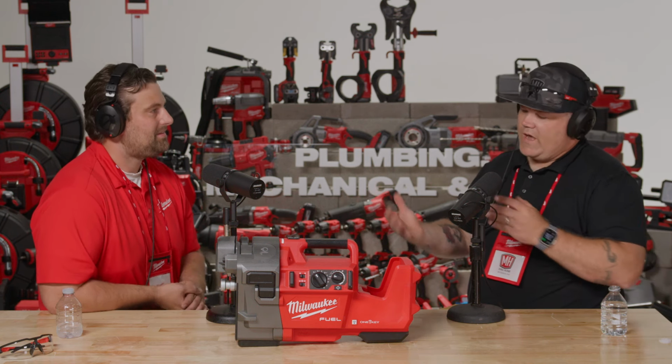Well, so this is just a complement to other pipe working tools in your portfolio, but really the first time you've answered the call for that fire suppression system where you had the threader. Of course, you've got other tools that work with pipe, but this is really answering that all around, replacing a couple tools in one. So now you've got the ability to roll groove pipe without the power head, without the accessory roll groovers that would fit onto the power head or the service groover, because this could do all of it.